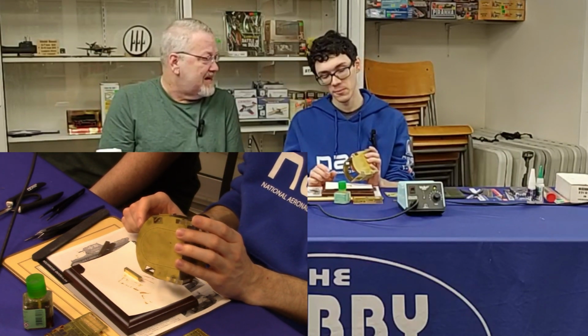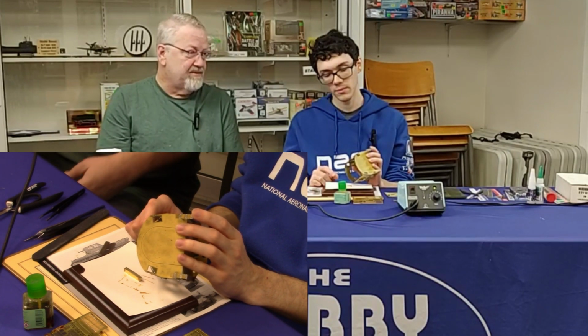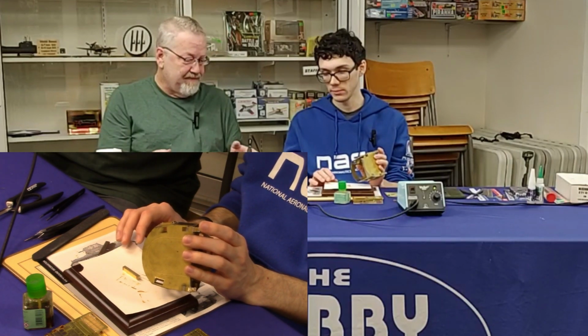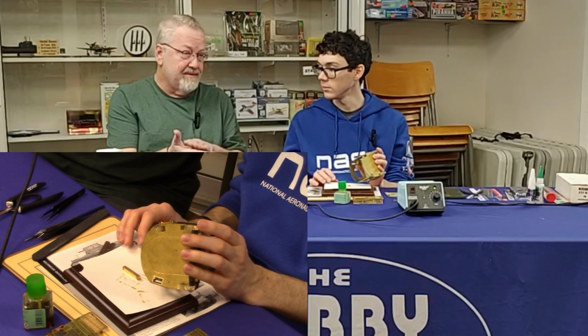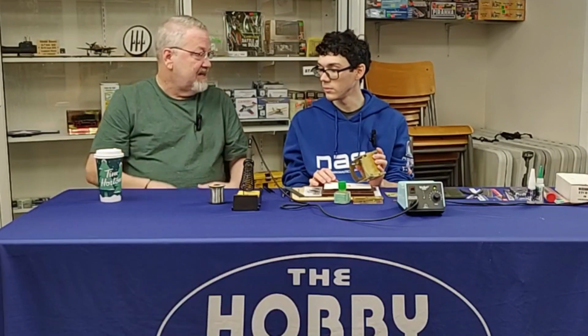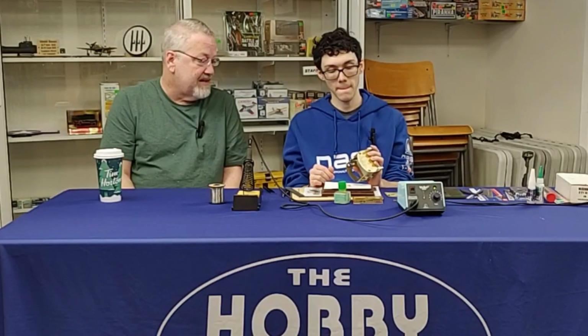It might be. What I would do with that, something I also didn't bring, you can get something called solder wick, which looks like the coating of a coaxial cable. It's brass or copper wire that is just interwoven. It normally has some flux in it, but if you add more flux and put it on the surface and heat it, it draws the excess up. And I should do that there. Otherwise, I can feather the edges and make it disappear.